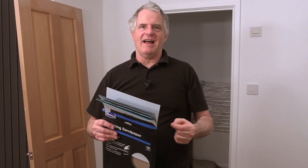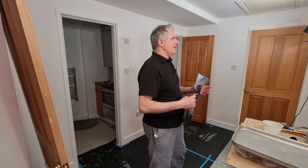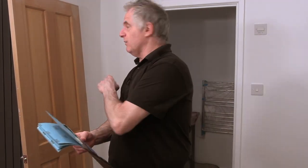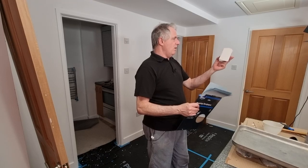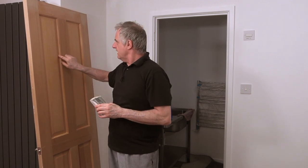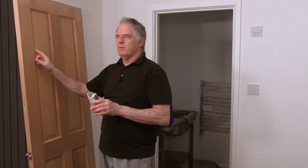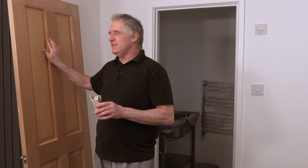If you want a really high gloss finish - I'm using a silk, or I could have used a flat version. I don't touch gloss at all, it's just too glossy. If you're using the varnish outside in the garden on a chair, you probably won't care which sandpaper you're using. But inside you do want your doors looking good. For this one I'm using a softer sanding block to get into these little grains - the rubber ones tend to get into that a bit better.